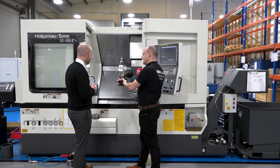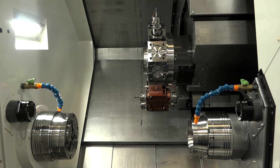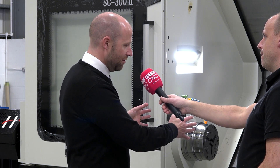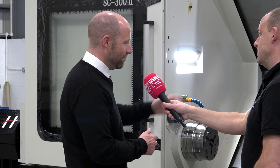Is the milling more than capable of handling all types of machining? Yes. With the AS product we have, we've put six of those machines into a milling environment where the spindle is literally acting as a fourth axis. The arrangement on this machine is aluminium extruded parts, so we need that high RPM. We also have a steel configuration going through the cell, which means we need lower RPM but more torque. And you can do that too — particularly on this machine that's where we have the advantage of both. We won't have the 20,000 RPM spindle like on the Chiron or a dedicated five-axis, but we've got the flexibility in this cell.